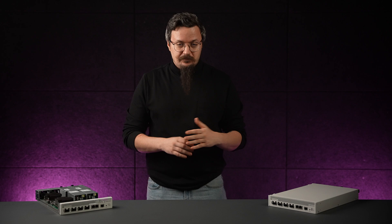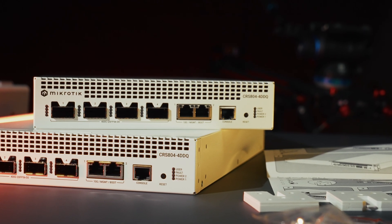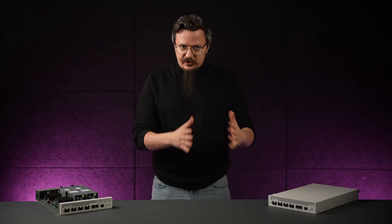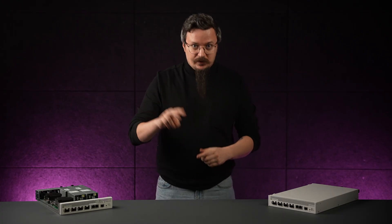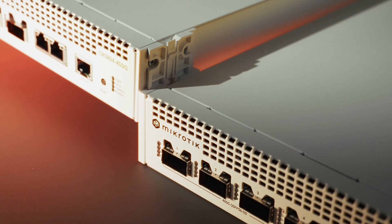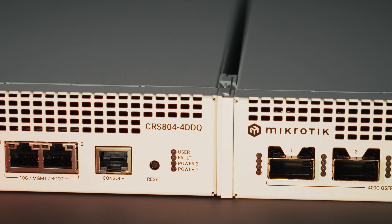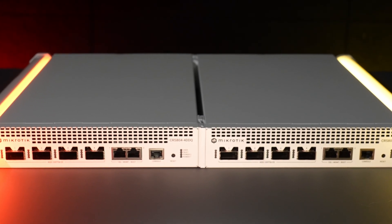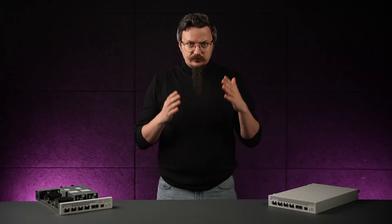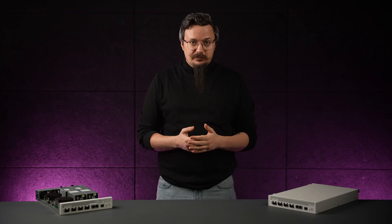Now here is where it gets interesting. A 400 gigabit QSFP DD port is not just one big connection. Inside, it is actually eight independent data lanes, and that's where the magic happens. Each 400 gigabit port can be split into two 200 gigabit links — perfect for AI and GPU clusters. Need storage on one side and compute on the other? Done. And if you're not at 200 or 400 gigabits just yet, each port can also work as four lower-speed channels like 100 gigabits or 40 gigabits, giving you both future-proofing and the future itself, if the rest of your setup is up for the task.